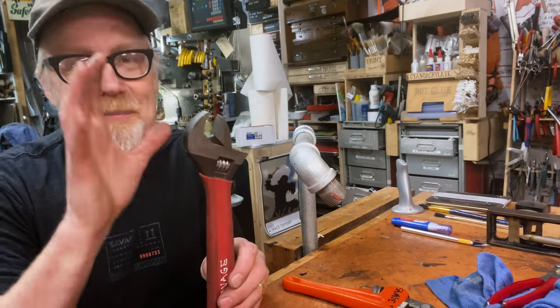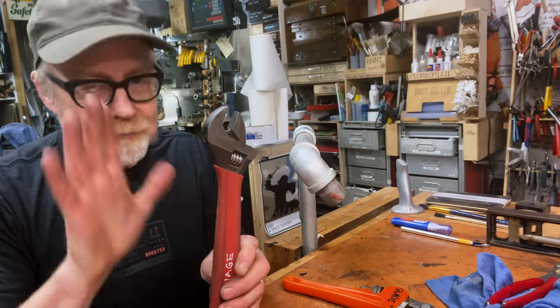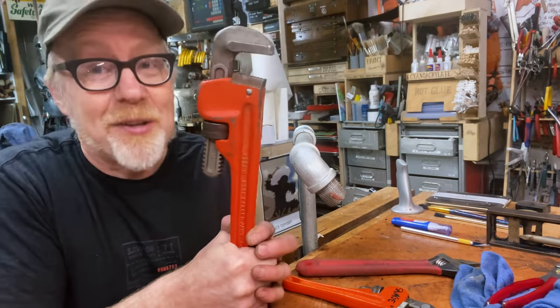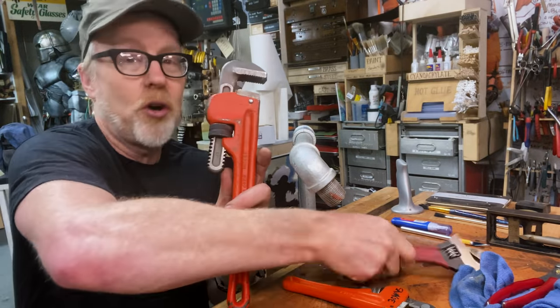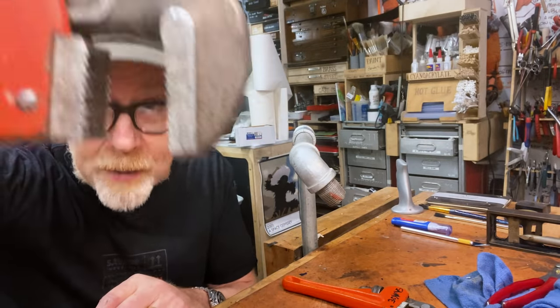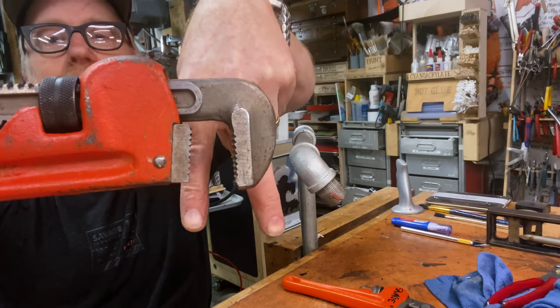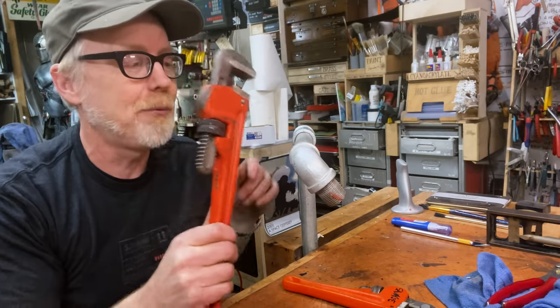They're effectively professional corner rounders — they can make life a lot harder. Pipe wrenches do what they do better than almost anything else you can think of, and it starts with the jaws. You'll notice the jaws of the crescent wrench are parallel. The jaws of the pipe wrench are not parallel — they are narrower at the back end than at the front. And that is how their functionality actually operates.